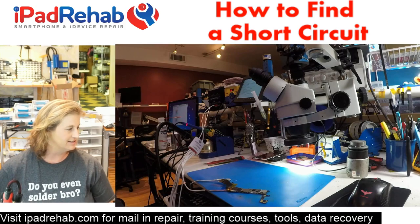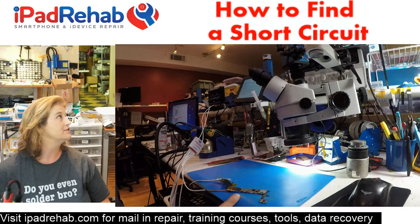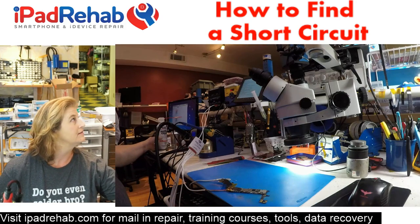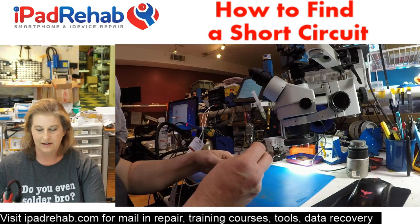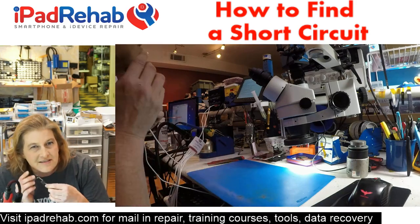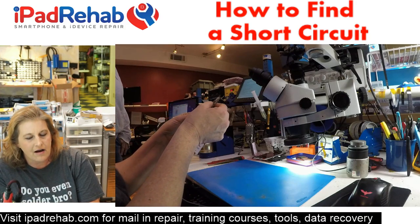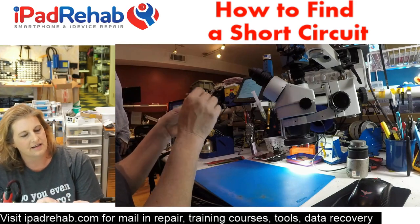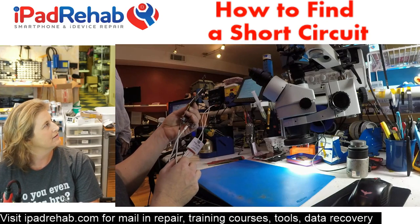All right, Sharon, here's the deal. What we're doing here is trying to find a short circuit on the board. And one of the ways that you can find a short circuit is to look for heat. So I'm going to use freeze spray, later, not right now. But the easy method here is to take the board. This is what I do. I'll turn it on, put current through it, and then I'll just go like this. Is there heat on it at all? And if so, how close can you get just kind of going like this? Is it this side, that side? Is it at the top or the bottom? And can you get to an area of the board?